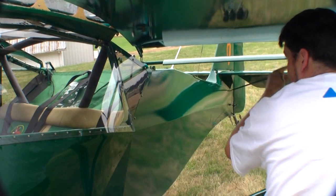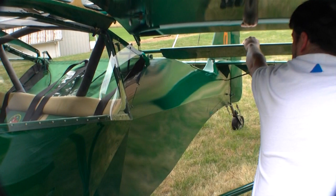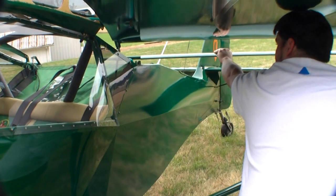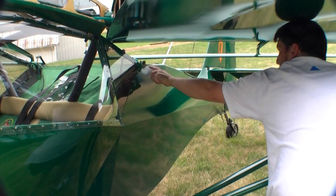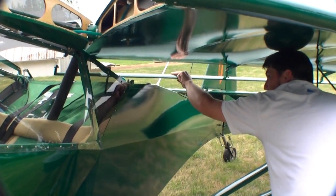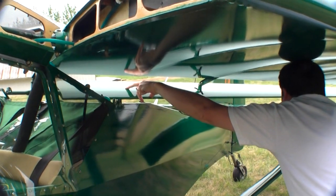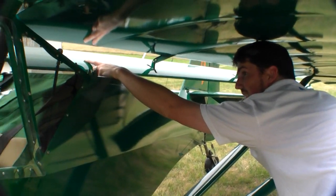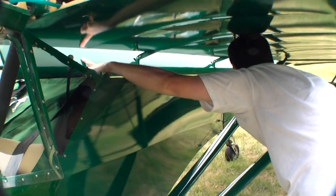Now at this point I've got all my parts in hand — you can set them down if you need to — but I grab the flaperon. I don't want this flaperon to hook down here; you can see that won't work. You've got to keep it level. Again, monitor this and make sure that's up out of your way. I'm watching for interface points here and here — you don't want to hit your flaperon in those. Keep your hand on this flaperon, especially in the wind. As I start to come in, I'm starting to rotate that flaperon slowly, making sure again not to hook right here by my thumb. Those are turtle deck attachment points — you don't want to hook those. Keep rolling, keep rolling, keep rolling.